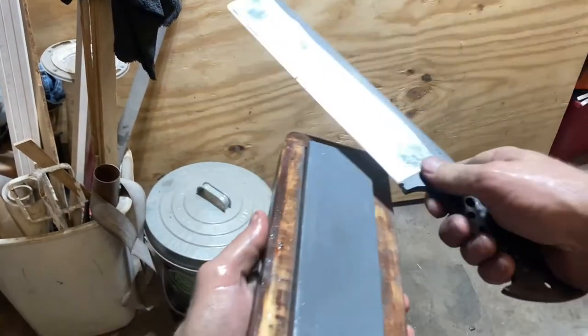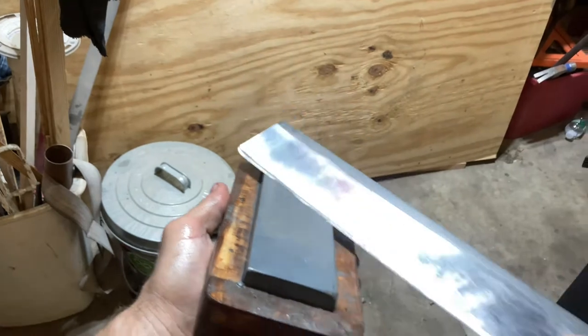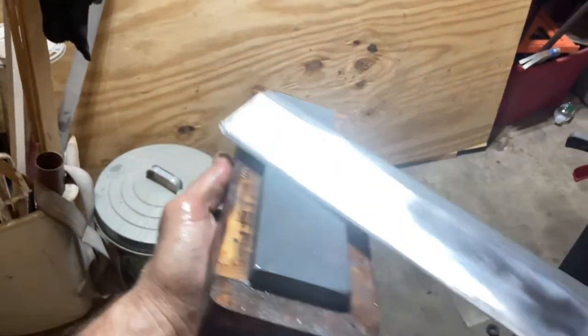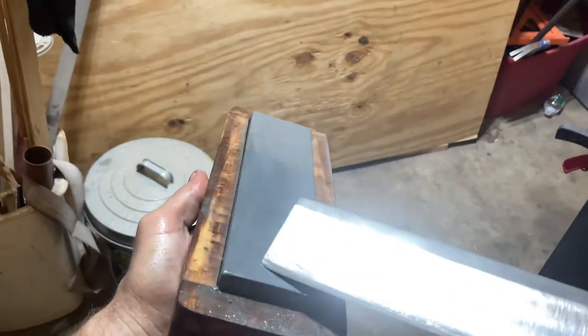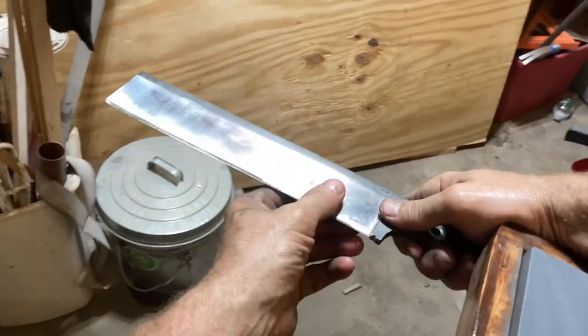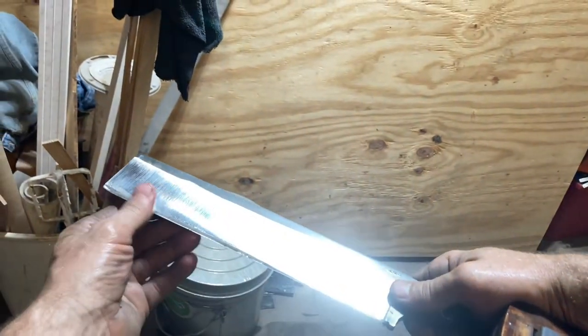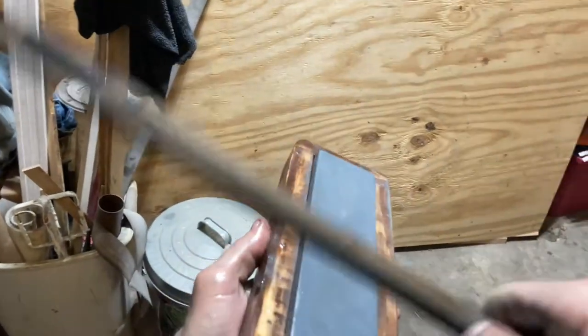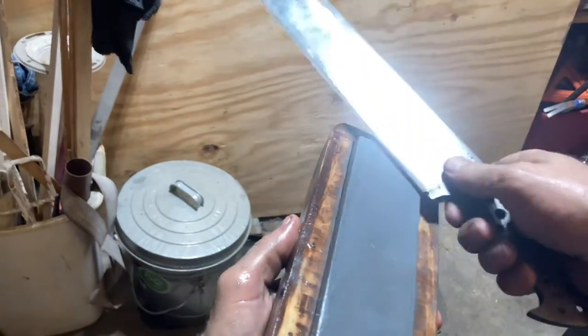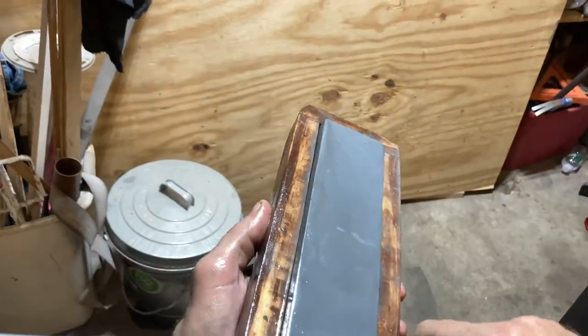That's one thing with a cleaver. When you got a nice straight edge like this, you got to watch out. You get them dumb dipty doos, make it look like you don't know how to sharpen. But I got that edge on the run right now. Just like that, it already folded back over. So at will, I can move that edge back and forth. So right now, I'm going to just try to get it right in the middle.